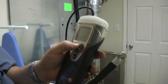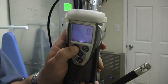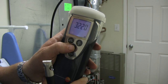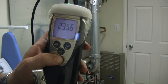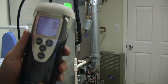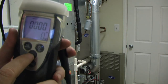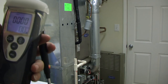On the mini vane anemometer, we're going to power it on, then push and hold the hold button — this is where we tell the meter how big our duct work is. We'll set it to 235 square inches and cycle through the menu. This screen will pop up and give you feet per minute. Then we're going to hit the mean button twice so the timer comes up, and hit the volume up to switch from feet per minute to CFM — we want to measure CFM.